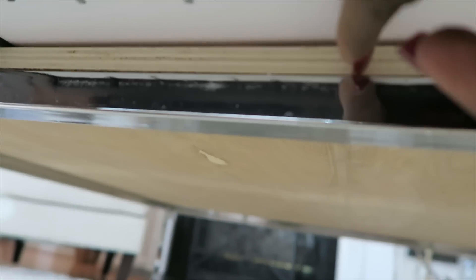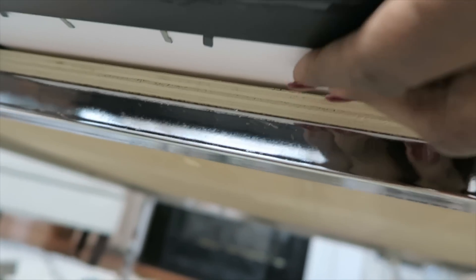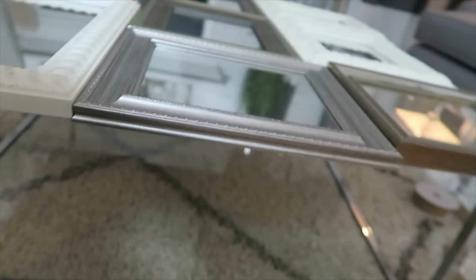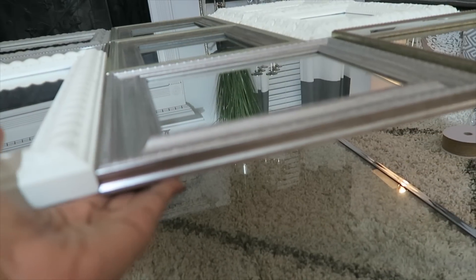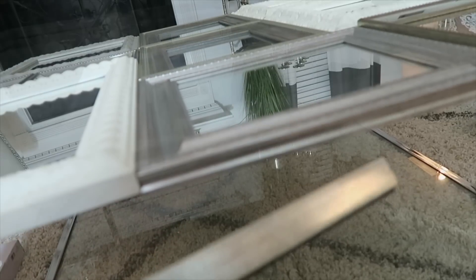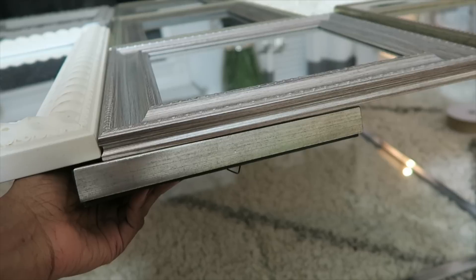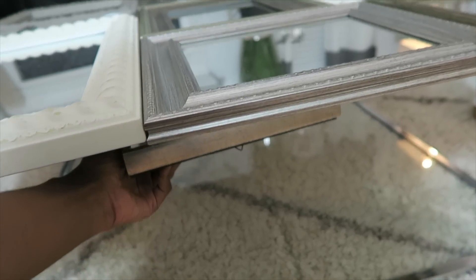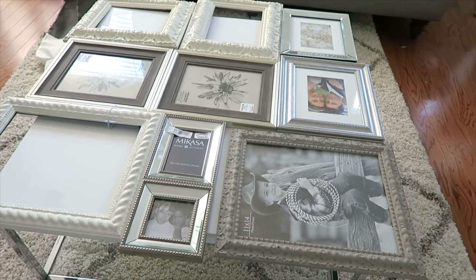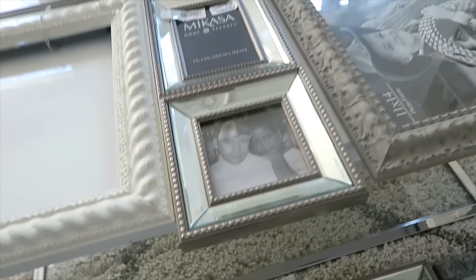What is key is that you want your table to actually be recessed. You don't want to butt the frame and the table together — you want the top of your table to kind of look like it's floating. I have MDF at the top of my table and I definitely didn't want that showing, so I made sure all the frames would come out at least three to four inches so you wouldn't see it once the table was complete. If you butt it right up together, when you're sitting on the sofa you can see it, so you want to recess it. Play around with it, stand back, look at it, take a picture of it to see how you like it, and just take your time with this process.